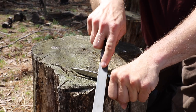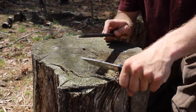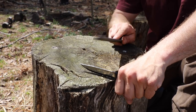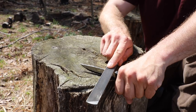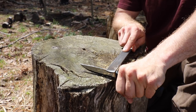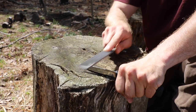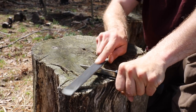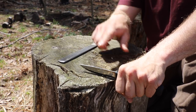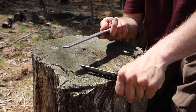It's very important that when we begin to file this, we're filing it flat across the spine of the knife. We don't want to be going down like this and we don't want to be going up like that at the beginning. Putting it on a stump eliminates a lot of that because there's just nowhere to go with the file — I can keep it flat. I just have to watch at the end that I don't roll it off. Keeping it nice and flat, I'm going to start right where the handle and the spine meet and just work upward. Files cut in one direction, so I'm just going to start cutting across very simply just like that. Continue that process and you'll see you're going to remove material and start to feel a sharp edge on both sides.